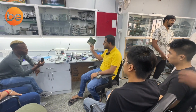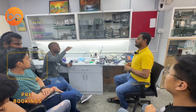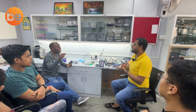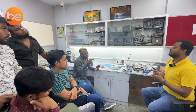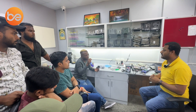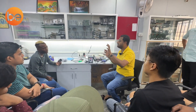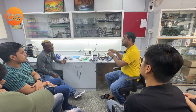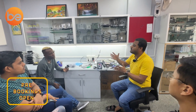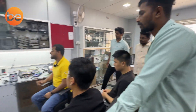Now let's check communication. The key data can be stored on different ECUs — for example, in Ford cars it is stored in the meter cluster or odometer. In Hyundai, it is stored in the Smartra and ECM. In some Maruti Suzuki vehicles, it is stored in both ECM and BCM. In MG Hector, we worked on BCM yesterday — it stores in the BCM. Each vehicle stores key data in a different location.